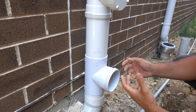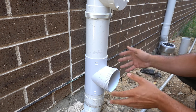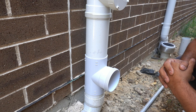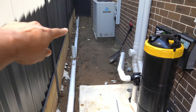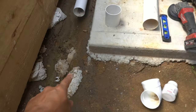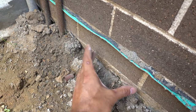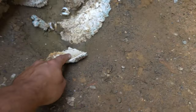Once you've got your outlet pipes or pickup points ready to go, you can then get started measuring and then cutting your drain grates or channel grates so you can get them ready for positioning. We're on the other side of the house now - you can see we've got our storm water running with a few pickup points, and we're going to install one right here on the end as well. We're going to have another grate running along here in between our down pipe and our water piping.